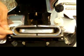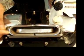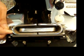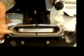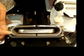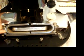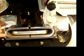There was a little after-fuzz on the strings, and it turned out the strings were a little too close to the pickup. I had that adjusted and it took the distortion away. However, taking it to an engagement, it was underpowered — so apparently the pickup is dead, although there's still some magnetization.